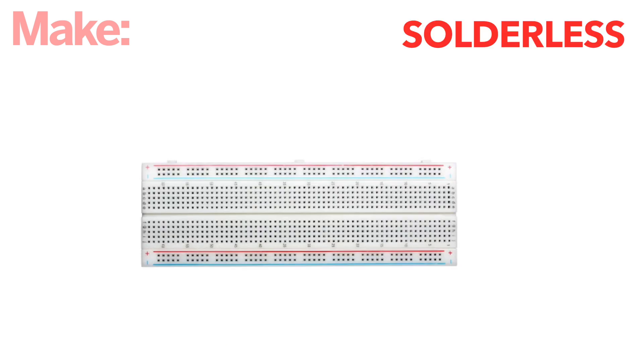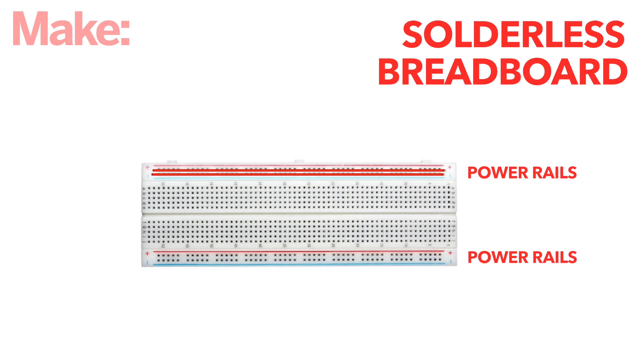This is a standard sized solderless breadboard. It contains a series of holes about a tenth of an inch apart where components can be inserted to create fully functioning electrical circuits. These breadboards are made up of a series of metal strips which facilitate both mechanical and electrical connections between components. This breadboard has two top and bottom power rails with metal strips running lengthwise horizontally across the rails, meant to be used by your power supply to provide power to the components. The rest of the breadboard is made up of vertical columns of those same metal strips, with the concept that two holes on the same metal strip are electrically connected.